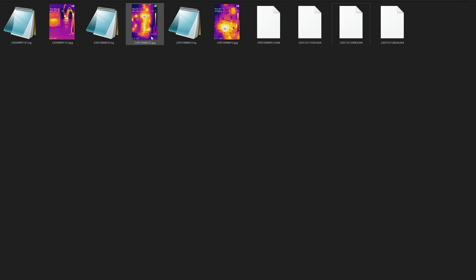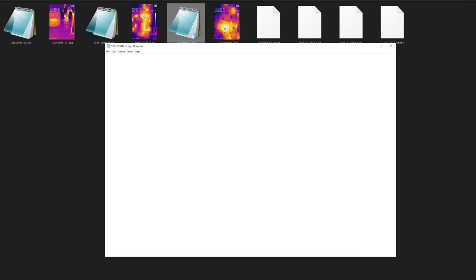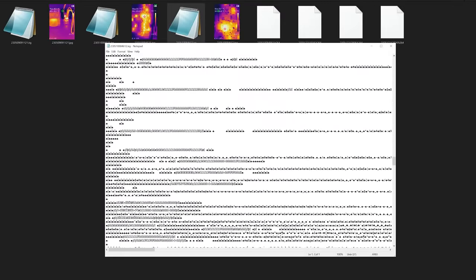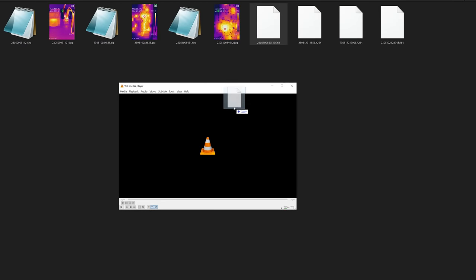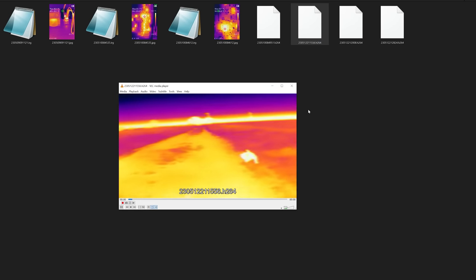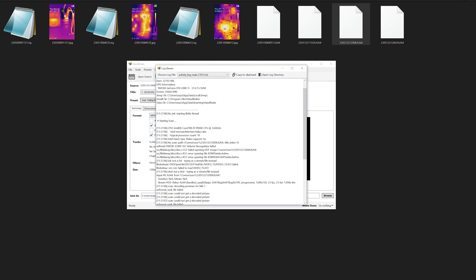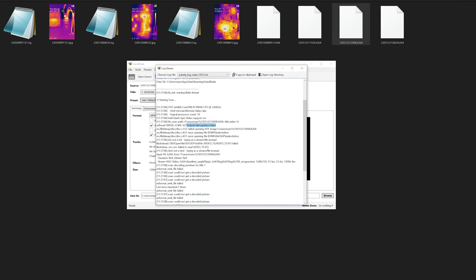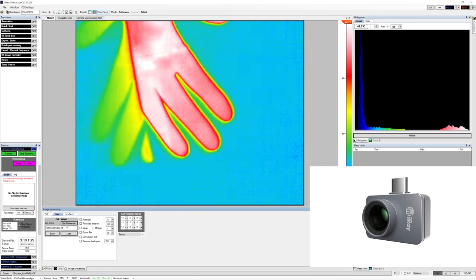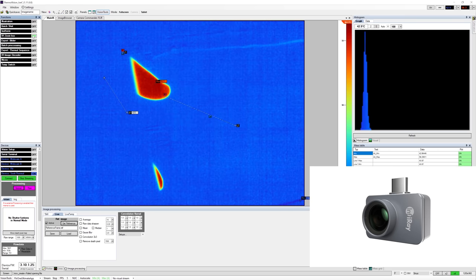When taking pictures with the normal trigger, the SC 240 M saves a normal JPEG showing exactly the display contents — the IR view in the selected color palette — and additionally a larger IRG file, which is a kind of raw infrared image format with a number associated to each pixel and maybe some additional infrared metadata. There is apparently some kind of Windows-only InfiRay software to read those and a Python converter on GitHub. The video files recorded by this camera have an h264 file extension but are in some unusual container that cannot be opened by my video editing software directly. A transcoder software called Handbrake manages it under lots of complaining. When connected via USB, the camera unfortunately only enumerates as an SD card reader. Had it also made a UVC webcam interface available, like a certain smartphone accessory does, that would have been amazing for integration into professional thermography software packages.